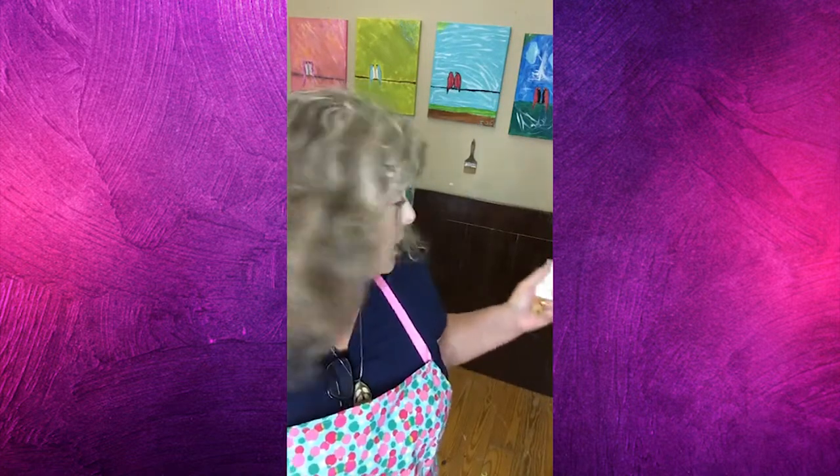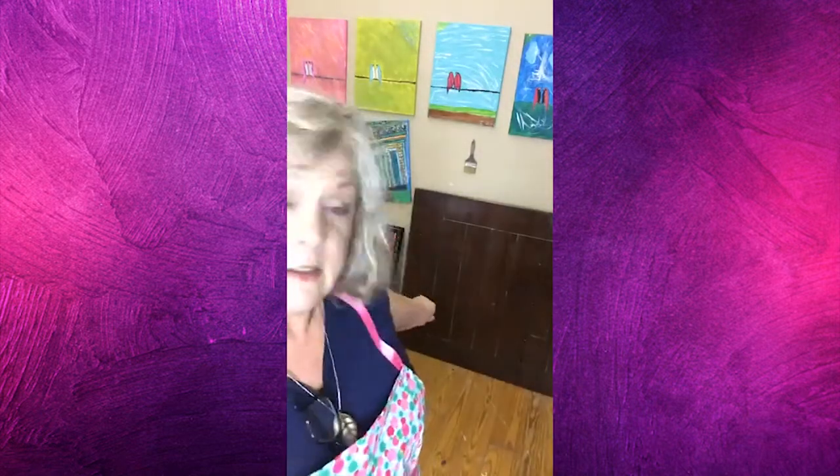I'm not going to sand it, because you don't have to whenever you're using the clay and chalky based paints. That's not part of the process that you have to do. But I am going to use Boss on it, which is a Dixie Belle product that blocks stains and odors. And I will probably, because of those deep scratches and because of the age and condition of the table, put at least two coats of that on there before I go with my red paint. And I haven't decided which red yet, but I'll share that with y'all whenever I do.